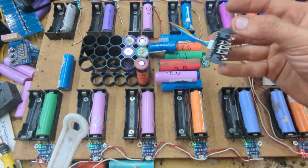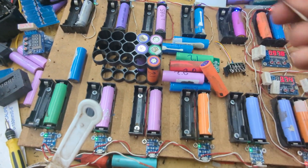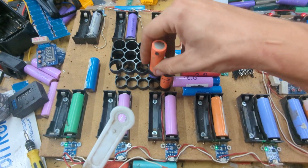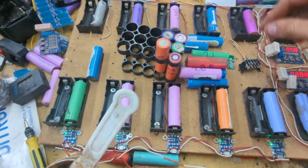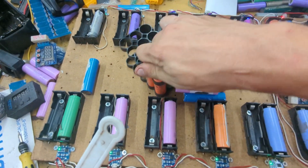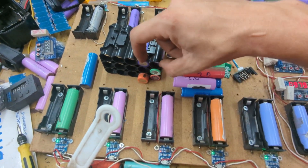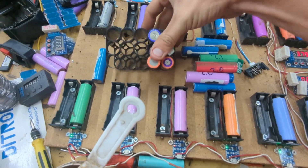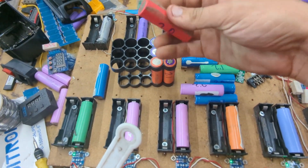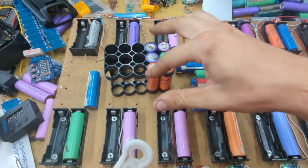Once you've got this soldered up, the next thing is just to drop the cells in. Different battery packs have different instructions — again, this is the DeWalt one. When you buy these assembly kits from AliExpress, they don't really give you any instructions. With the DeWalt one it doesn't matter as much since the PCB board comes off with wires. For example, if you were to get the Ryobi kit, they actually have the PCB board all the way across, and you simply have metal strips that go straight onto the PCB board.